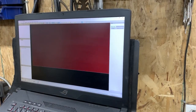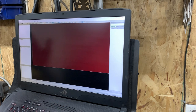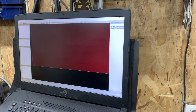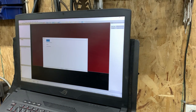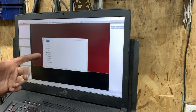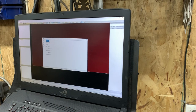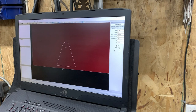We're going to need a couple of lugs or some type of tabs to mount our ram to. We're just going to go into SheetCam — SheetCam actually has a bunch of basic shapes already in the software itself. You can have all sorts of different basic shapes: your circle, convex rectangles, your donuts, brackets and mounts, gussets, L-gussets, web stiffeners for your I-beams, cam locks, slotted plates, and so on. What we're going to go into is brackets and mounts, and I think we had a lifting lug — we're going to utilize that for a couple of eyelets or ears or tabs to mount our ram to.